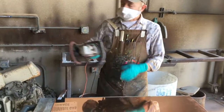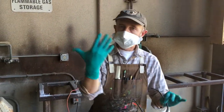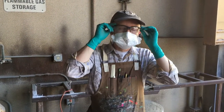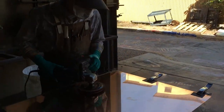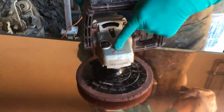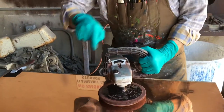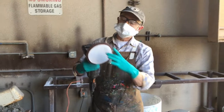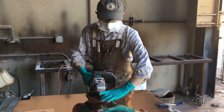Now when you're using this thing, I'm going to put my safety goggles down. I'm wearing nitrile gloves, safety goggles, and an N95 mask — not a normal surgical mask — because I need to actually be filtering out particulates. This is going to spin; there's an arrow that shows you the direction. When I'm holding it this way it's going to spin clockwise. I only want the area between noon and 9 o'clock to be in contact — I'm not going to put the tool down flat or angle it down too far.